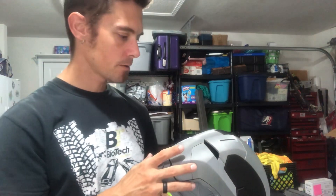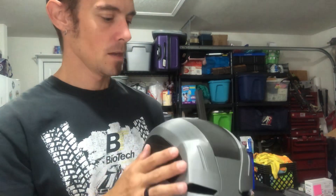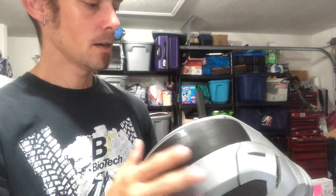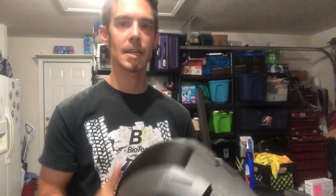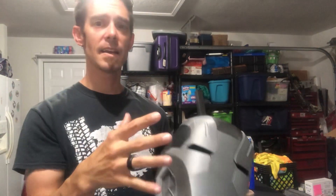From an inspection standpoint, don't worry about this gap — this is just hot glued together so the glue separated. It's a pretty good print. We've got your typical Z banding; I'm only using a 0.4 nozzle. My infill settings had only a 0.8 millimeter shell with two layers on the wall. I do that strictly because I know I'm going to sand, smooth, and paint these. If you're doing a raw print, you'd want probably a 1 millimeter shell and at least three walls. I personally don't focus on getting the print perfect because I know I'm going to do sanding, filling, and refining.